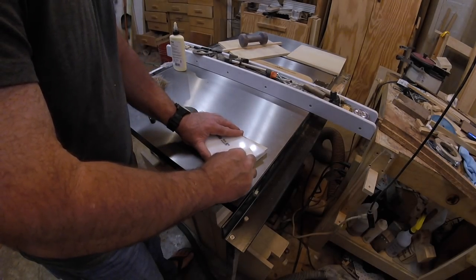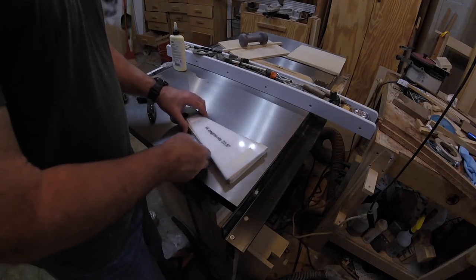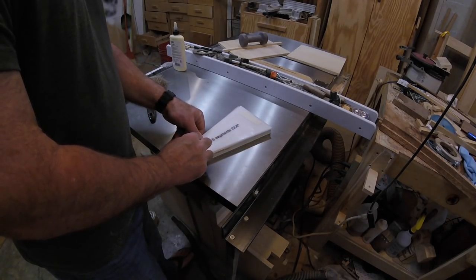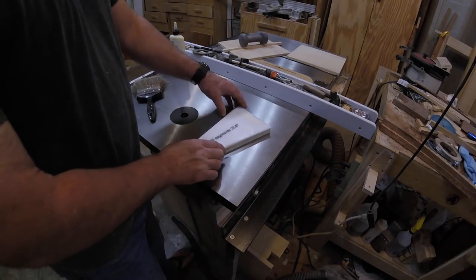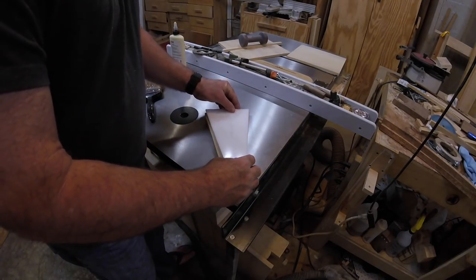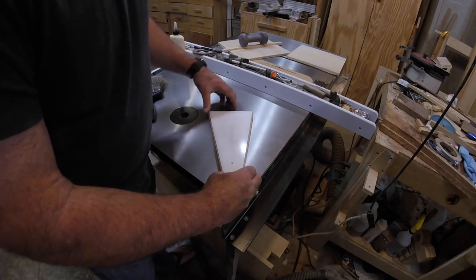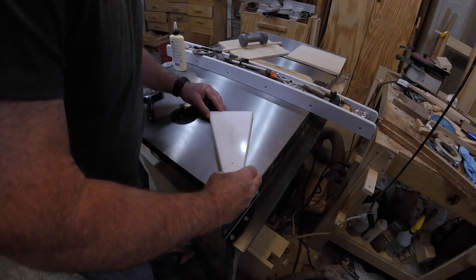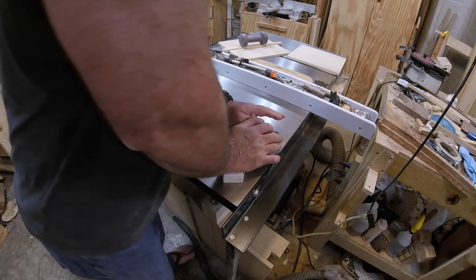This is a simplified wedge sled, because rather than use the wedges to set adjustable stops on the sled, I'm just going to use the wedge itself. I guess it's a holdover from my guitar building, but once you get that perfect template made, the only thing you use it for is to make another template. Always keep the original as the master and work off the copies. So that's what I'm going to do here.